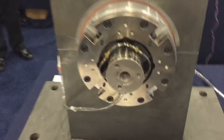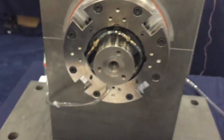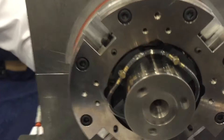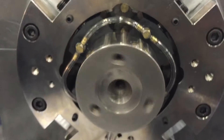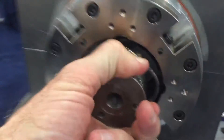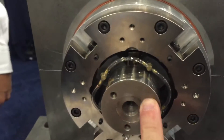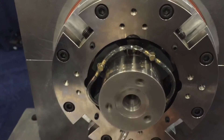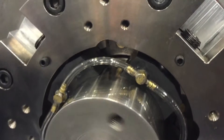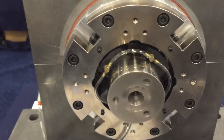The carbon bearings also perform well at very low temperatures, having a low coefficient of thermal expansion so they stay with the proper radius. These bearings are significantly preloaded — if we pinch off the air, you'll see it comes to a complete stop, and it's so hard preloaded that I can't turn it at all with the air pressure off. Now turn the air on — and now I can turn it with a single finger. The air film in the air bearings is stiffer than the structure preloading them onto the rotor, and when you turn the air pressure on, they push away and make their own clearance.